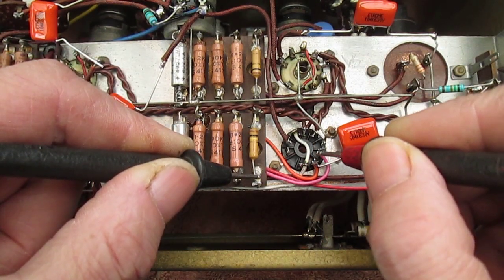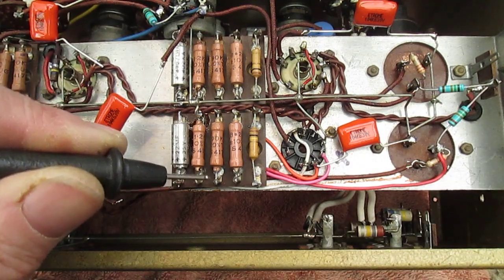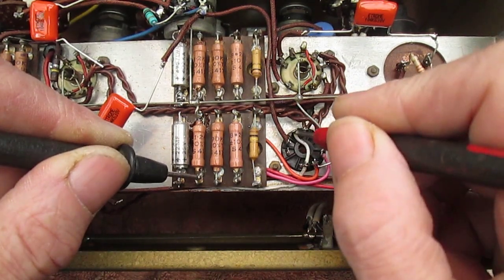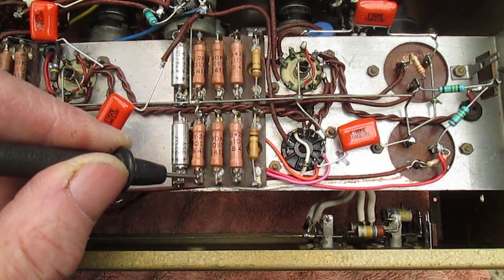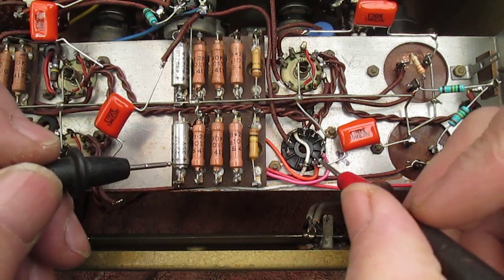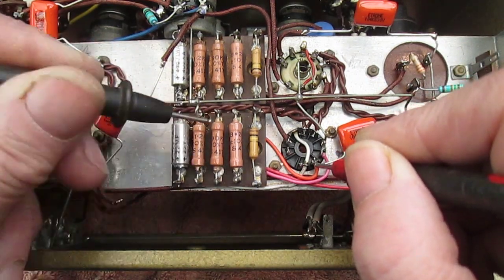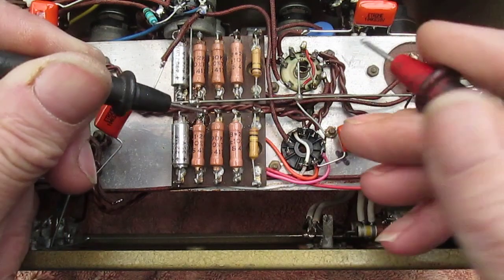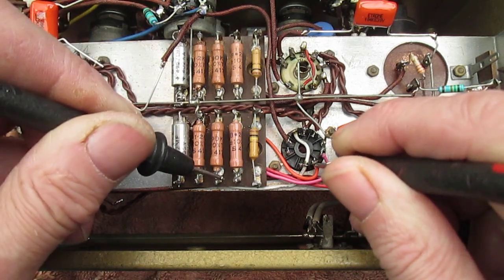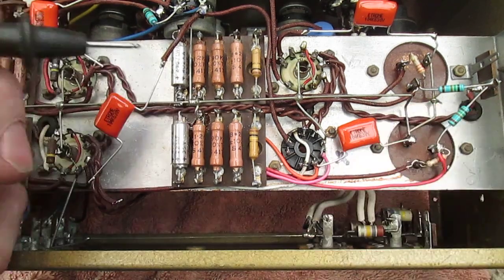Oh, yes it is, that's correct. Cathode is this one. There's a cathode, but it's also connected to our G3 suppressor grid. What else we got? Cathode, anode, G2 goes to the 8K2. No, that's idiot, 390. There we go. Come on now. Just the leads are tarnished. So that's correct.